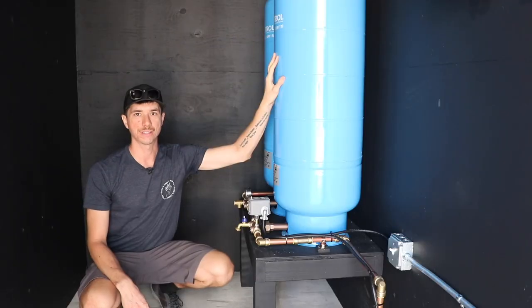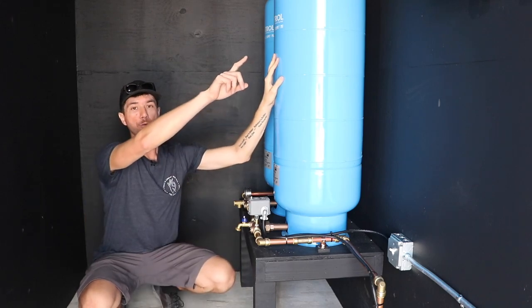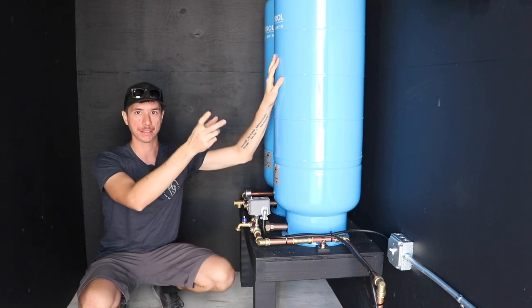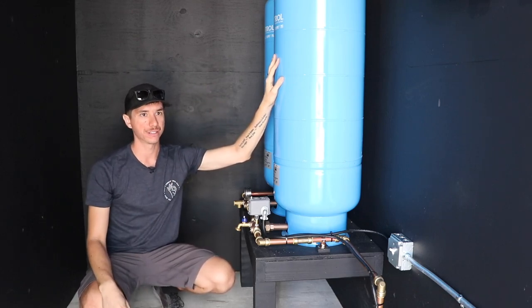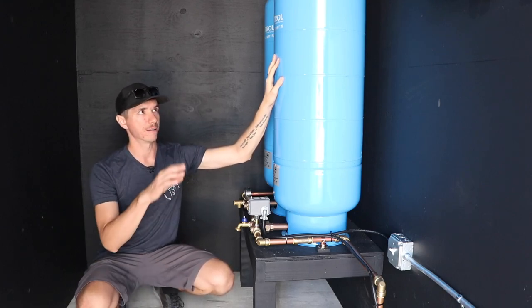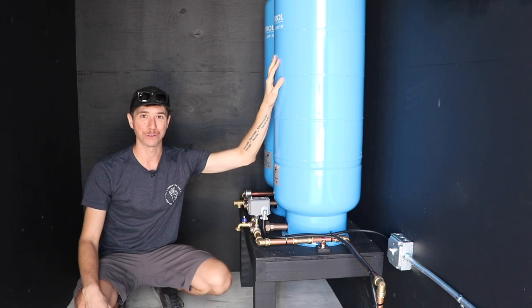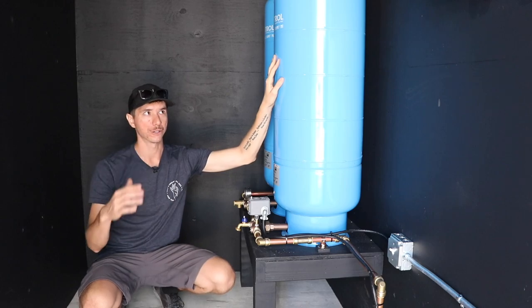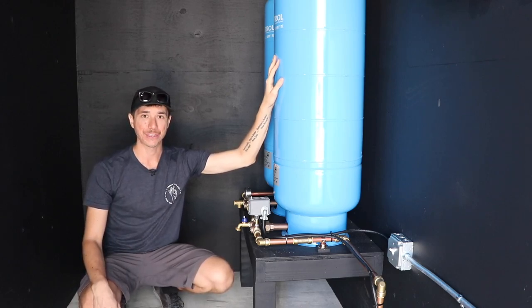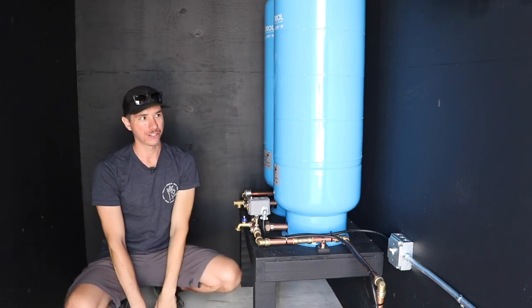The system is pretty well done. The main thing I still have to do is plumb something up for the sediment filter so it automatically rinses every day or every other day to keep it cleaner — we've already got some bugs in it drawn in through the tank. It'll be pretty cool to automate that process, but you still have to come around and clean those filters every once in a while. Awesome guys, thanks so much for watching — if you have any comments or questions, leave them below and we'll catch you on the next video. Peace.